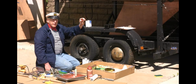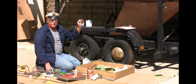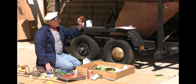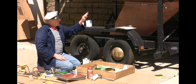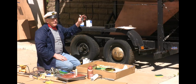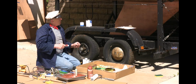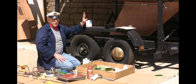It's a soft material, but our chemist pointed out that our boat bottom paint will seal it anyway. So if you're using a little softer material, it's a little easier to sand, and you can then just seal it with the boat bottom paint. And even though it's a softer material, we've got our original putty on here from 4 years ago. Nothing has ever come off. We've never had a problem with any of our Bondo sliding off. And even though we put it on over the top of this copper Teflon, it sticks nicely, and by sealing it in, we don't have any problems. The nice thing is each year the boat gets better and better and better.